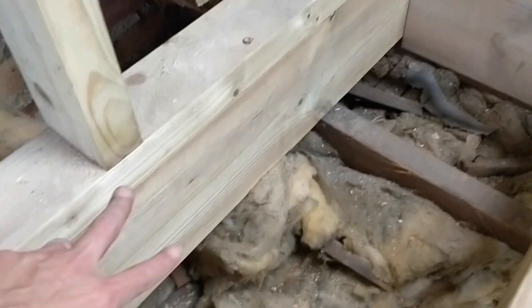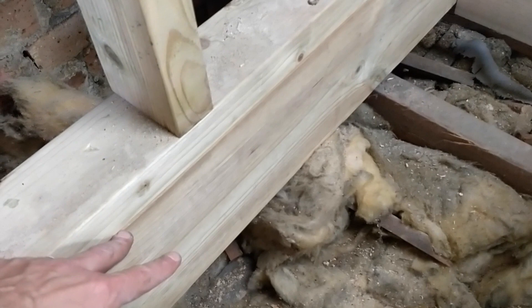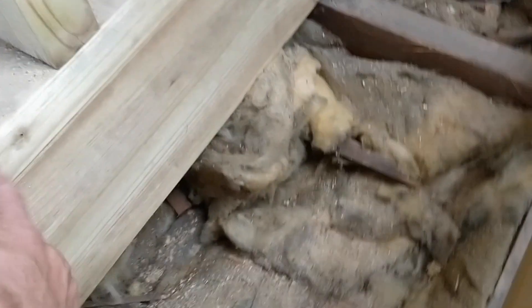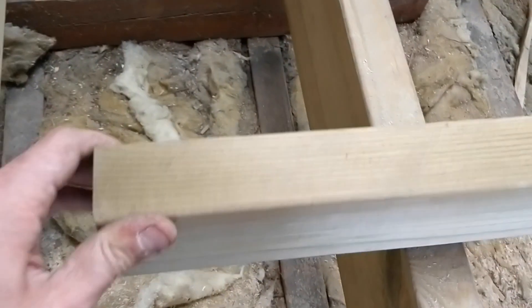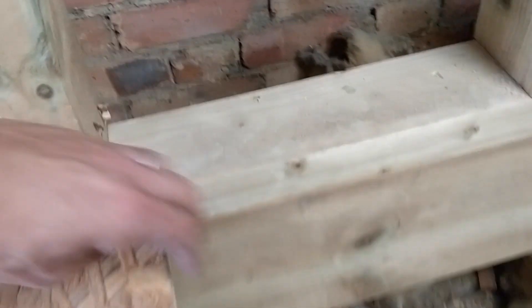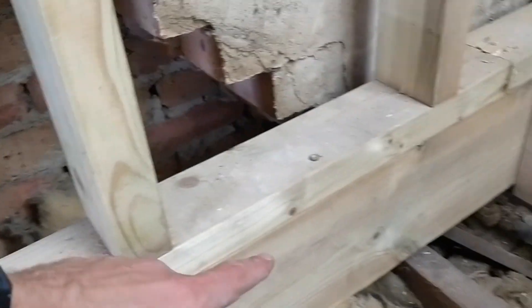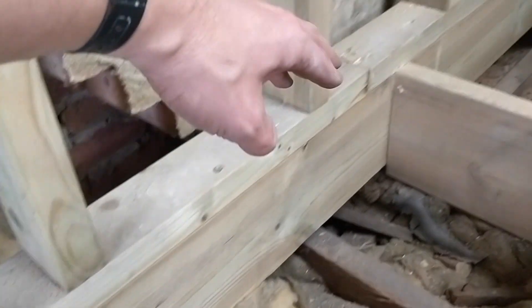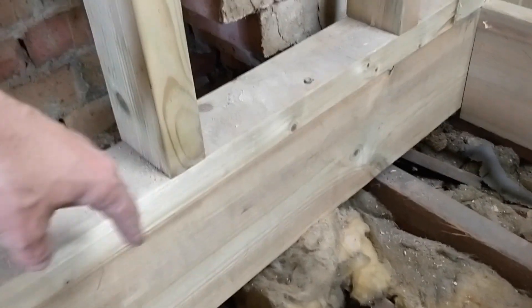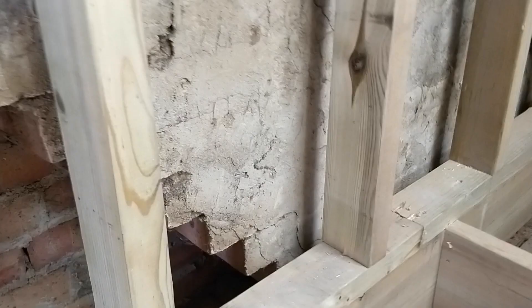At this end I'm going to drill the hole, and then I'm going to be putting an extra 2x4 in here as support for the floor — so I'll actually drill lower than this so I can put the 2x4 up nice and strong to give support for the floor. This one's sitting on a joist so I've got extra support here, but my chipboard flooring is only 600 wide, so I need to have something in the middle just to offer a bit of support, and I'll do the same all the way along.